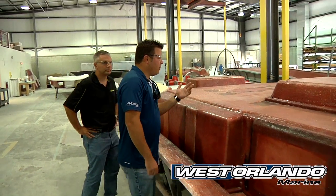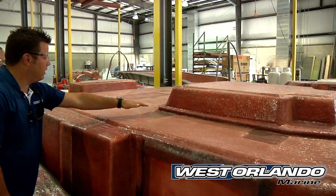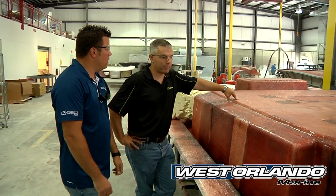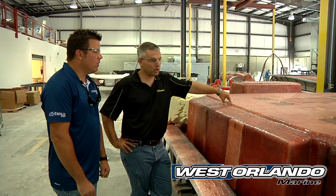I've looked at a lot of boats. I know some manufacturers actually screw the leaning posts and T-tops directly down into the fiberglass floor. I see these little inserts cut out on the bottom here — can you explain what those are? We actually don't use aluminum. We do drill and tap our leaning posts and T-tops, but we use a material called phenolic. The reason for that is that over time, a stainless fastener and an aluminum plate can create a galvanic reaction and basically bond themselves together and rust. With the phenolic material, we'll never have to worry about that. It's just as strong as aluminum and it bonds just as well with the composite materials we use.